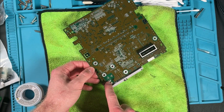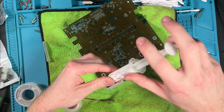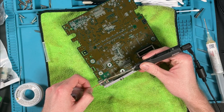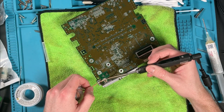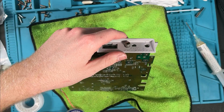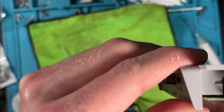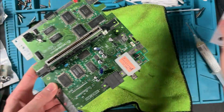Now that we know it works, if it doesn't in the end we know it's my fault. Let's desolder these two points with some desoldering wick - get my flux out, put it on there. Get the desoldering wick - you can smell the 1990s dirt and grime sticking to this. There we go - there was just a tiny bit of solder keeping it from coming out of the holes. There we go.